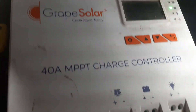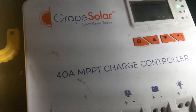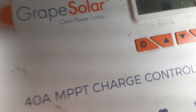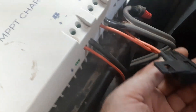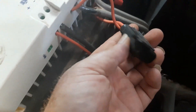The good thing about this charge controller is that it can do 12-volt and 24-volt systems, so even though I just reconfigured from 24 to 12 volt it still works, and it automatically reads what it is — that's pretty nice. I put in some fuses; normally you size the fuse for what it is. I put a 40-amp fuse but I couldn't find one, so it's a 30-amp fuse. It's been working so far.